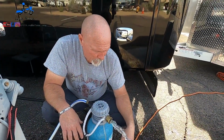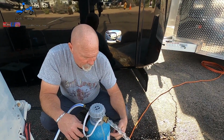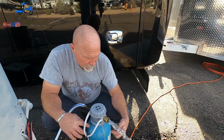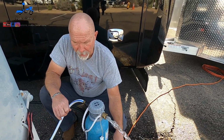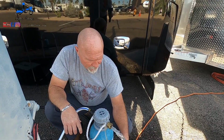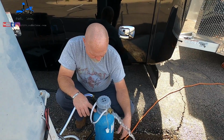So do you have to recharge the resin as well? You do, but it says that as long as you follow the back flush and the recharge, which is to add salt, and you use Iron Out occasionally if you're in particularly high iron content areas, the resin in these should last 10 years. Oh, really? That's what they said. That's a long time.